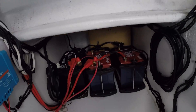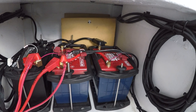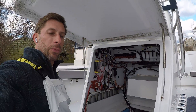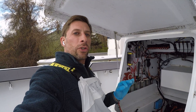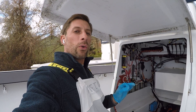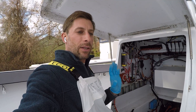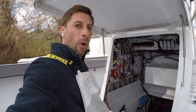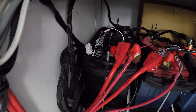I put these two Dakota 135 amp hour batteries in. They're actually a dual purpose battery, so they can be used as a cranking and deep cycle house battery. But my question — and I'm sure many of you have the same concern — is that the outboard manufacturers, on this boat I have a single 300 Suzuki, and Suzuki as well as Yamaha, they want you to only use a lead acid 1000 marine cranking amp battery. They don't want you to use a lithium battery with the outboard. With outboards being very expensive, I didn't want to jeopardize my warranty. It was actually pretty easy — you're still able to keep your lead acid starting battery. Right there, that's my lead acid starting battery.